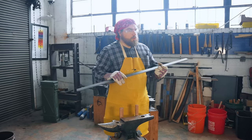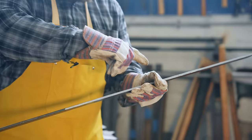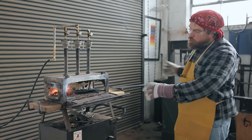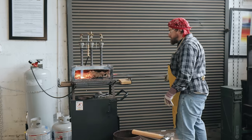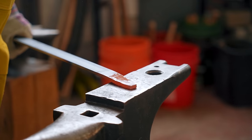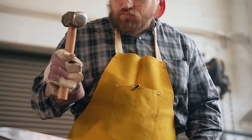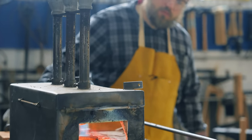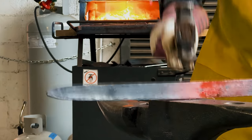The first thing I'm going to do is heat up this piece of metal, forge out the tip, and then as I work down, start to get those curves in there. This type of forge has two portals on either end so I can push longer pieces of metal through — I'm not limited by the size of the forge. I'm upsetting the metal, compressing it so it gets thicker, and I have to counter that by turning it and hitting down to keep everything even. Right now I'm just trying to make it straight and tapered, ever so slightly tapering towards the tip before I start putting the curves in.